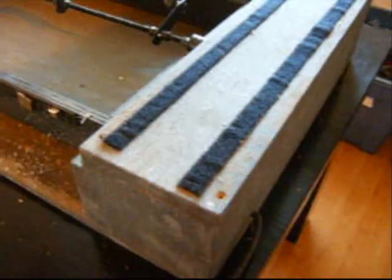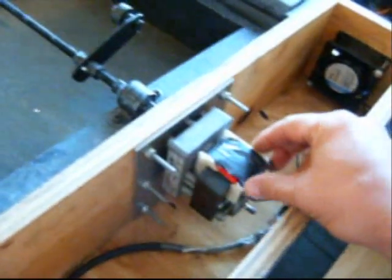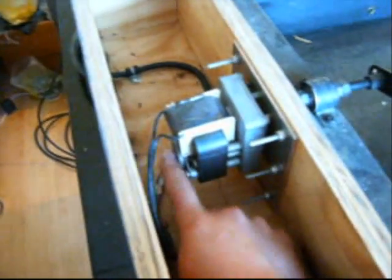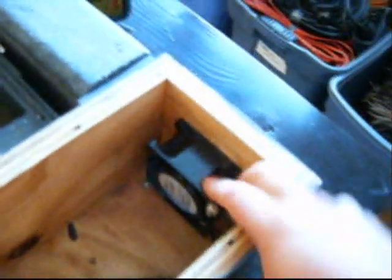The gravestone, like the other ones, is just usually held on by some Velcro. I unscrewed the lid to show you guys underneath. Here's the motor I use — I've seen it before in other YouTube videos. This one came from McMaster-Carr, and I'll post the part number. I basically took a flat aluminum plate, drove a hole through it to mount the motor to the plate, and then screwed the plate to the wood. There is a fan that comes on these motors, but this one was broken. So just to make sure I didn't have any heating issues, I put this little muffin fan — like a computer fan — on the side.